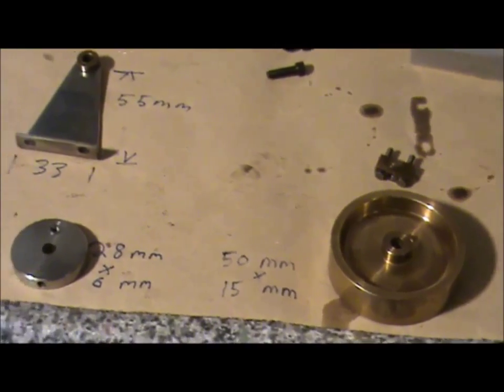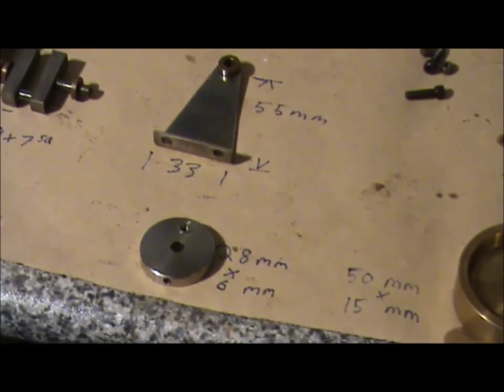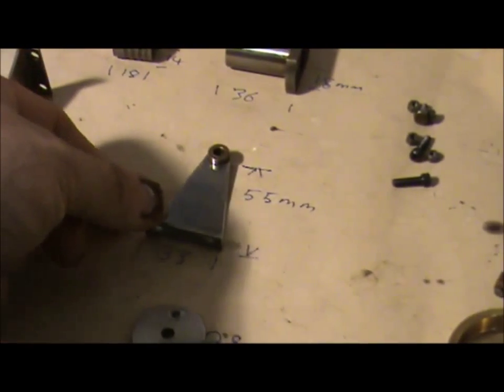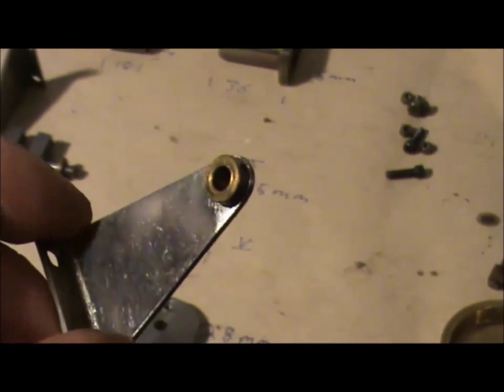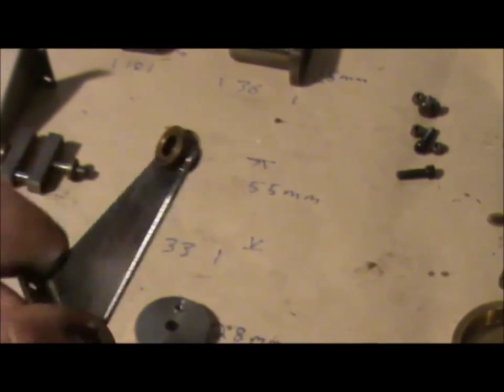The small crank wheel is 28mm diameter, 6mm wide. That is one of the supports - as you can see, 55mm by 33mm - just a simple turned pressed fit, nothing special. No ball bearing; if you had a ball bearing race, I think you can get about 10mm, and that would be better.